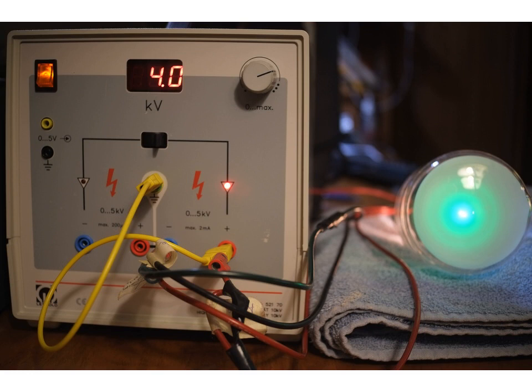I think as long as you maximize the window so it fills your full screen, you'll get about as good precision as you're likely to get from this. The main limitation is that the rings are simply fuzzy. You can either measure the diameter of the ring, which means you're measuring from the fuzzy ring to the fuzzy ring on the opposite side, or you can measure from the central dot to the ring, which means you're measuring the radius. I find that easier because I think the dot is so well defined and easy to see. It makes that error associated with locating the dot negligible.